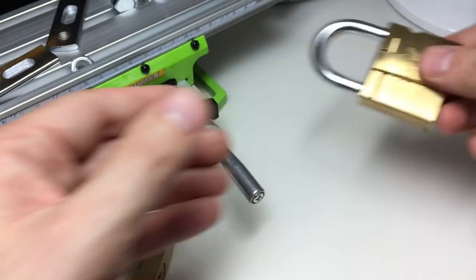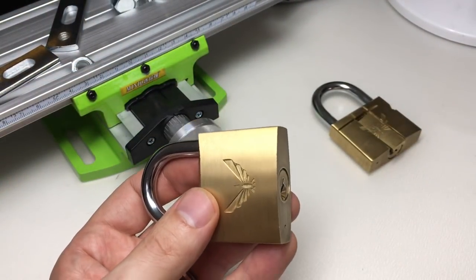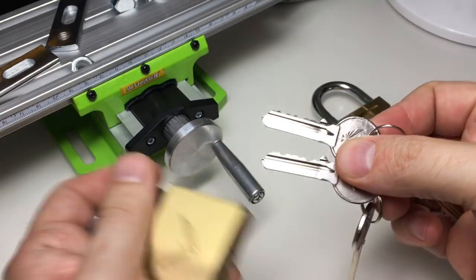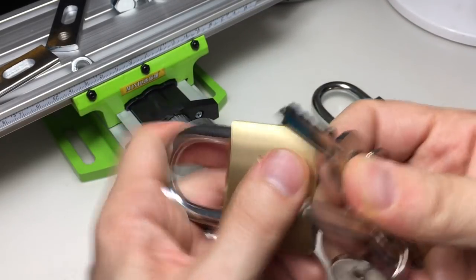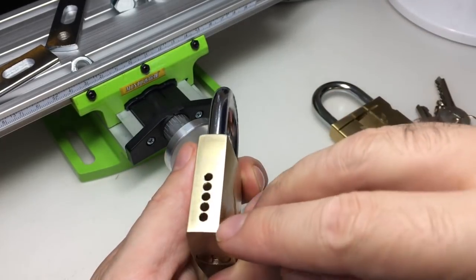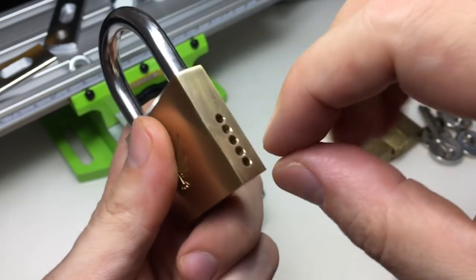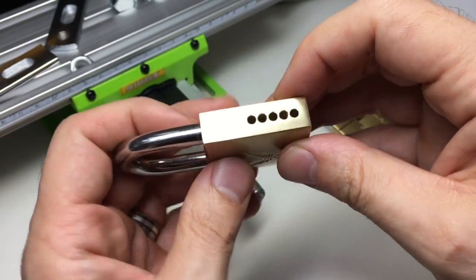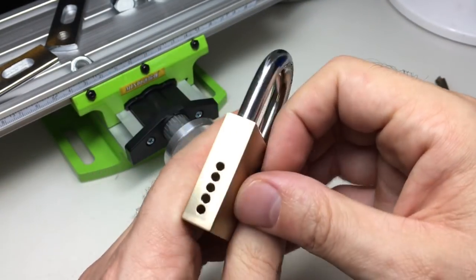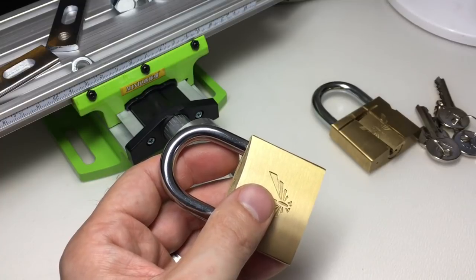It's interesting because you can see how I drilled those out. This lock now operates with any key that will fit — I've got two keys with completely different bittings, and because there are no pins, they both open the lock. In the next video what I hope to do is use a tap and die set to tap some threads in here, put some little threaded screws in the top, and then we can have a padlock which you can progressively pin up with different security pins.